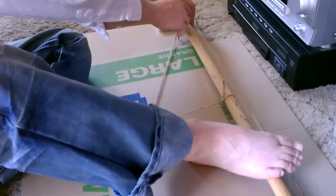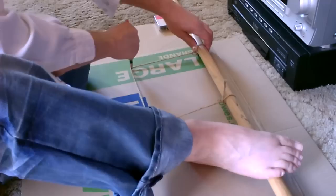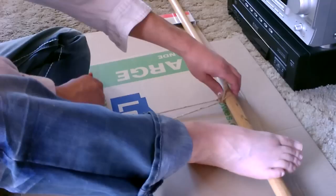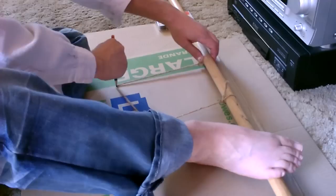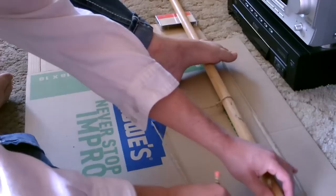It's pretty simple — just take your pencil or pen, hold it out like this, slide forward, keep the string taut, and slide evenly so you get to the center. Just like that — that draws a perfect parabola. Now you just have to do the other half.